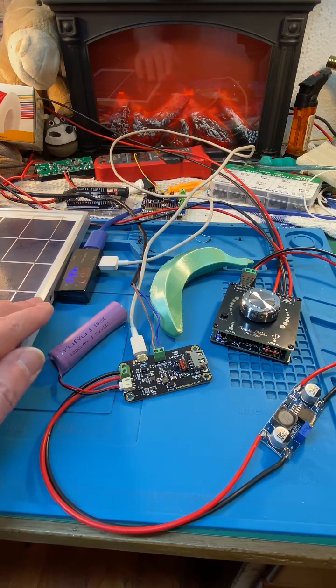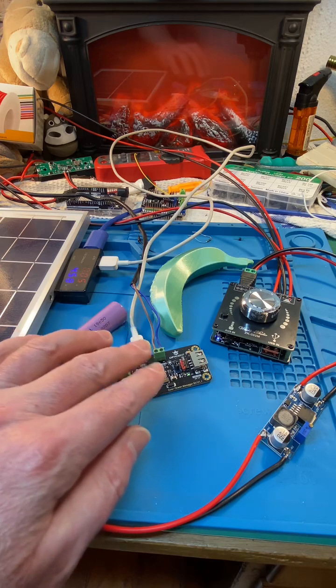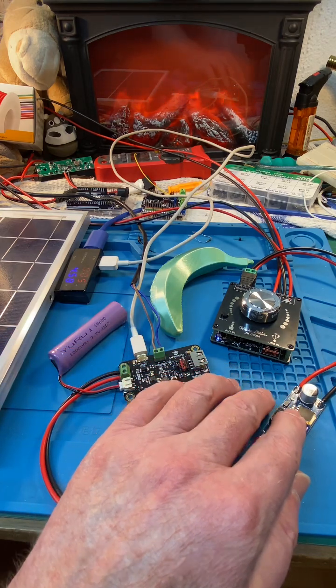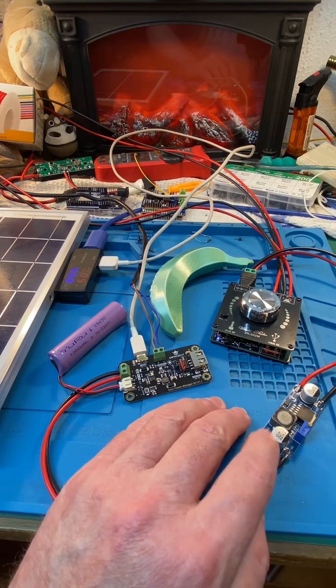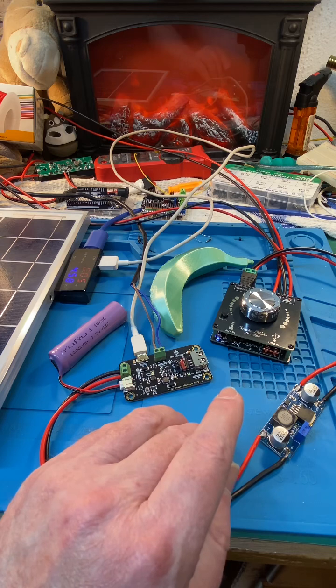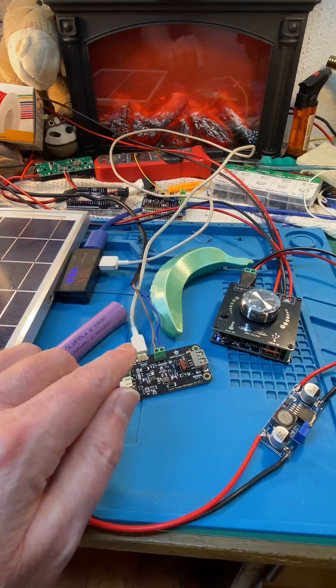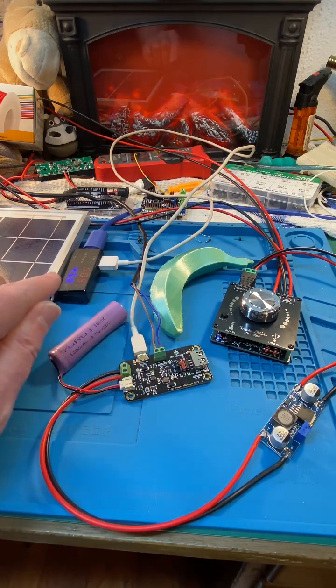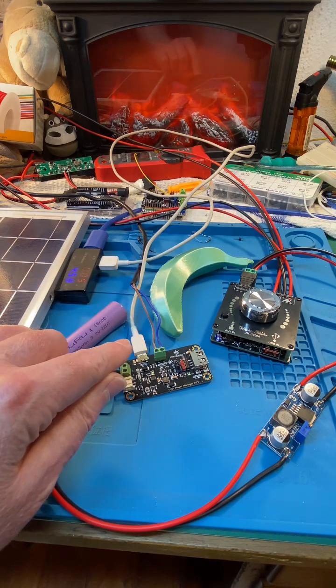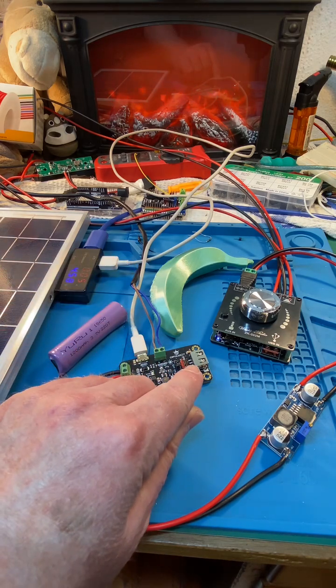So that's what you need: the solar panel, battery, charge controller, and boost converter which will give you an adjustable voltage — I've set it to 18 volts — and then your Bluetooth player. I'm currently charging it off USB because we're indoors, but additionally you can of course take five volts from there.